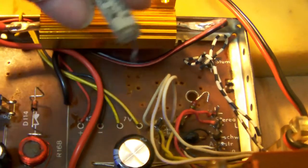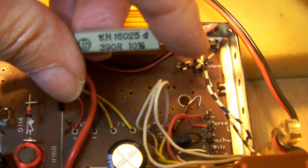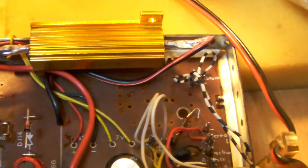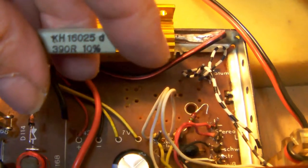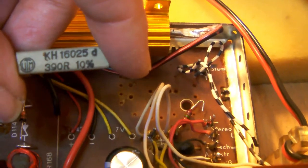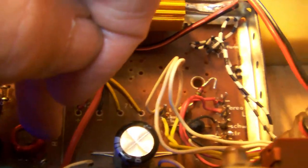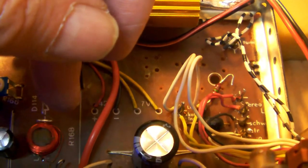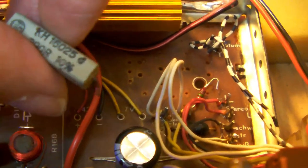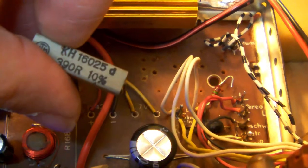Now, this resistor became ridiculously hot. I mean, like, burning hot. So, I didn't like that very much, because I'm convinced the heat of this resistor also degraded one of the traces to which it was soldered. You'll remember one of the traces was broken. So I said no to that, and I removed it altogether and replaced it by this 50 watt 430 ohms.